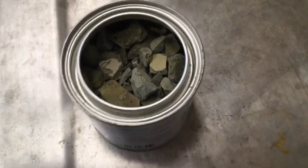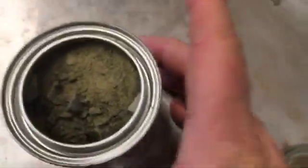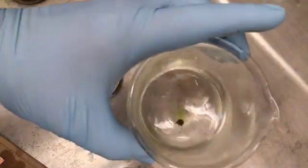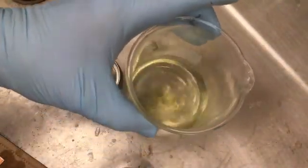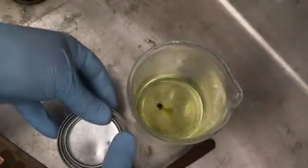If you're having a hard time finding small enough pieces, put the lid back on firmly. Turn the can upside down and shake it gently for a few seconds — you're not trying to break the crystals into smaller pieces, just making the sizes trade places in the can. Turn it back over, take off the lid, and enjoy the greater range of options. Drop the rock in the water and let it dissolve. You can agitate the liquid to speed this up. Close up the liver of sulfur can by placing the lid back into position and leaning on it until it pops back into its groove.